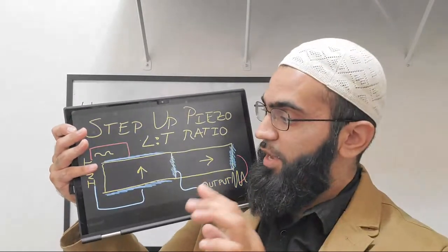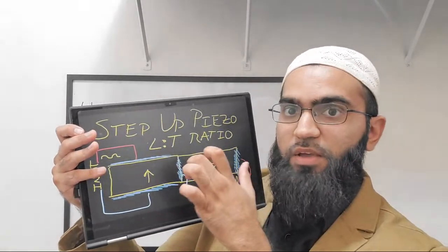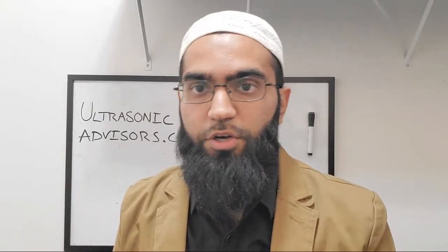Making the output side very long and the input side very thin makes the effect even more drastic. If you make the input side a multi-layer configuration, it becomes even lower impedance, and the impedance difference becomes even greater — allowing you to generate kilovolts of output from a simple topology like this. Used in reverse, you get the inverse transformation, though typically you're not stepping kilovolts down to volts at this small scale.